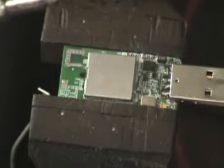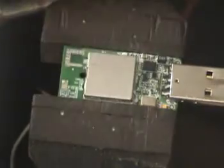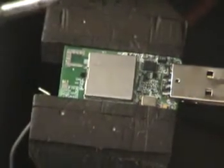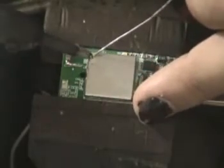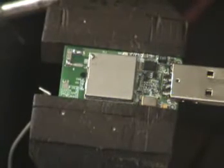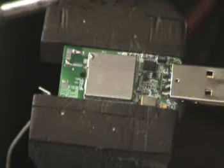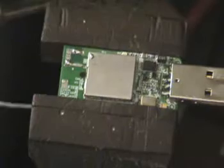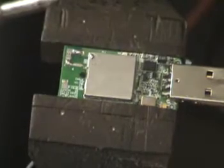From there, you just take a very small razor — in this case I've got a surgical scalpel — and we would just cut this track. Once that track is cut, it's a matter of just taking a little bit of solder, pre-tinning it there. You can use the shield as ground, as always, or solder directly onto the signal point. Using your continuity meter, you can find other various points for your ground. Usually any kind of shield or negative voltage return can be used as a ground point. From here, you'd just solder on your coax as normal — center conductor from the coax to the signal, and solder your ground to the ground, just like we did with the USB adapters. This is just a much smaller scale.